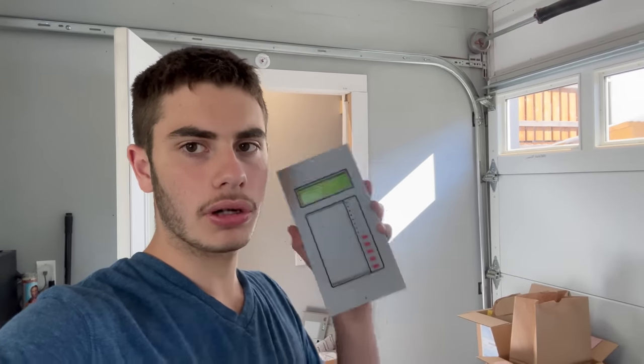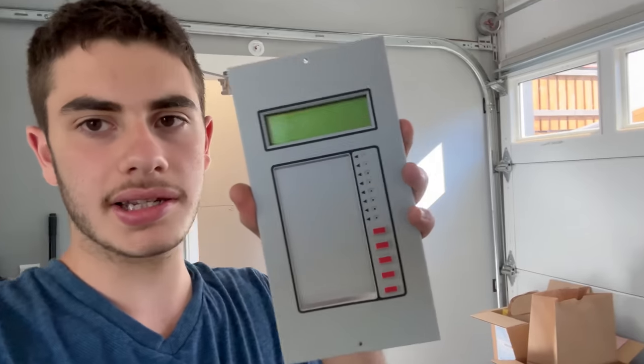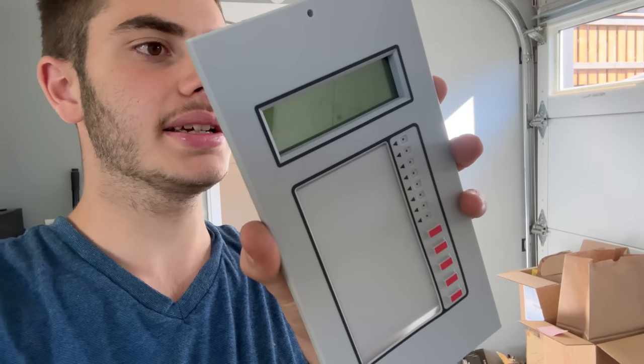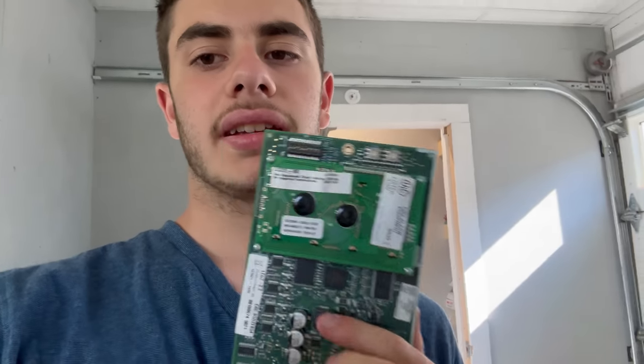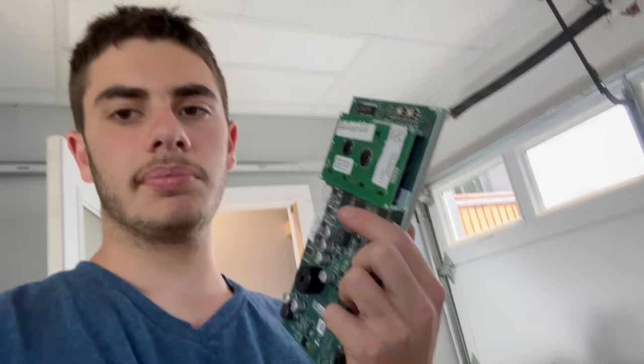So let's decide where we're gonna put our pull station blocks up there. One thing though, before I can put this pull station in, is I need to actually figure out where the annunciator is going first, because the annunciator is harder to move and it's going to kind of dictate where the pull station mounts. So for now, we're gonna figure out this annunciator. This is a, what is it, LCD 2-80. I believe I'm gonna need 6 connections to it. I'm gonna run it terminal.